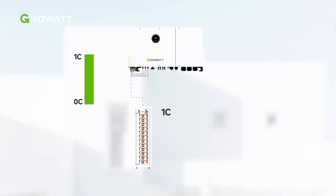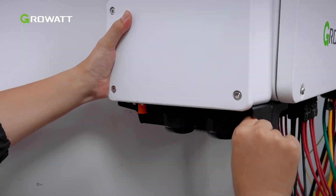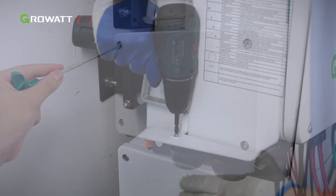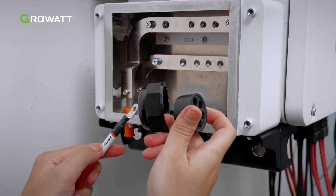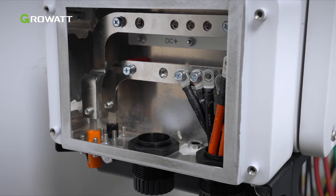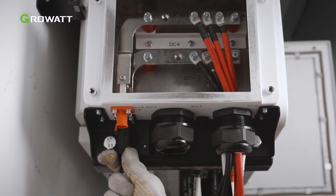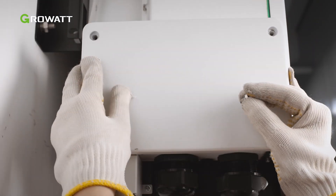Here is an introduction of how the junction box should be installed and wired. Before wiring, please check the terminal on the bottom of the junction box as shown in the photo. A battery terminal for third-party battery has been reserved — please use it when required. The battery junction box can be mounted on the inverter; please ensure it is firmly installed. Remove the cover plate and protection cover of the junction box. Connect the tap line to the junction box, then connect the battery cables to the junction box and tighten the protective cover. After wiring, install the cover plate.